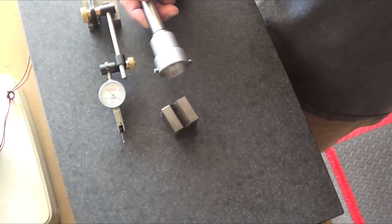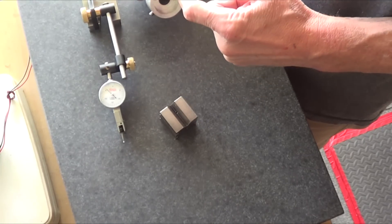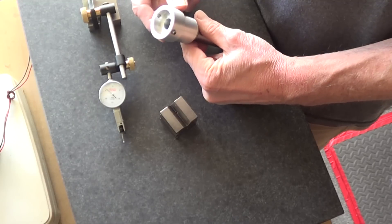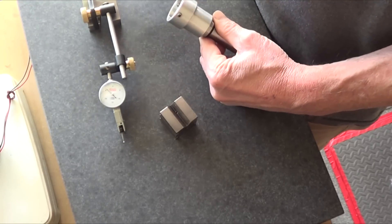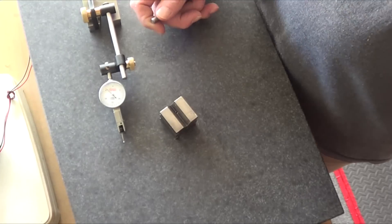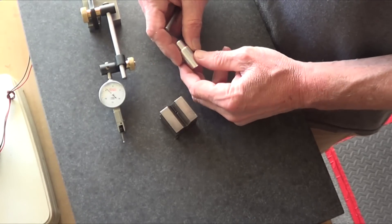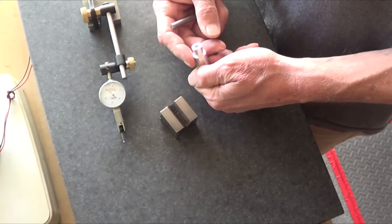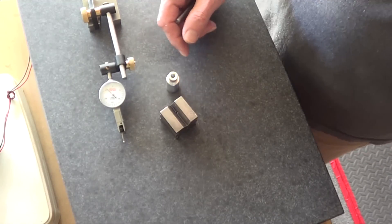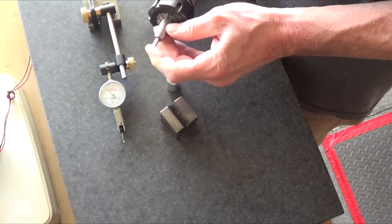I'll have to clean that up. This was stuck in the spindle, and the final finish — especially this end — was turned while it was in the spindle, so I know this is absolutely straight. The die is placed in here, and then this is in an ER-32 collet, quarter-inch threaded. This guy is tapped the same way — it's in the ER-32. The tap is held in position, but this guy — I think you guys have seen me build this spring-load setup.